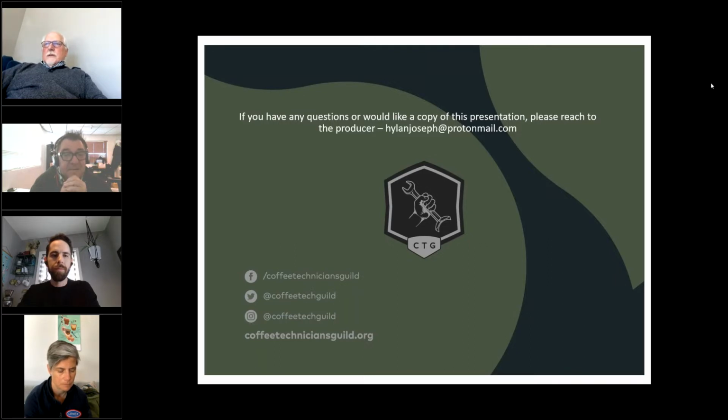It'll do all kinds of crazy feedback stuff, because in a lot of cases in commercial environments, you'll have an outlet that's connected to a metal conduit. That metal conduit goes all the way back to the box. If you connect a neutral wire to the ground inside the machine, you're feeding back voltage through that neutral wire and the ground, which is the conduit going back to the box, all at the same time. So neutral and ground always have to be isolated, because the ground is what keeps you from dying or melting the machine down.